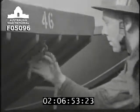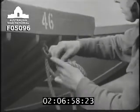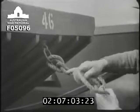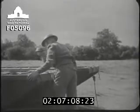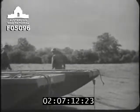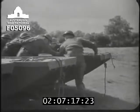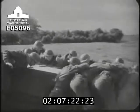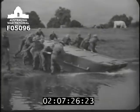We're now ready to build a raft. The minimum party required is one or two NCOs and 18 men. The breast line is attached to the ring at the bow of each pontoon with a fisherman's bend and coiled on deck ready for use. The pontoons are then launched — all this may be done as each pontoon is unloaded. This is how they should not be launched: the men aren't working together, they're not lifting the pontoon but are dragging it.